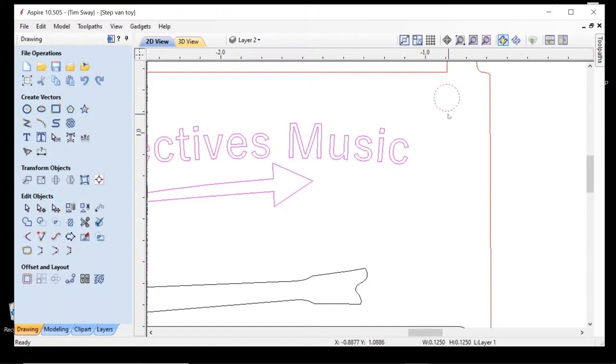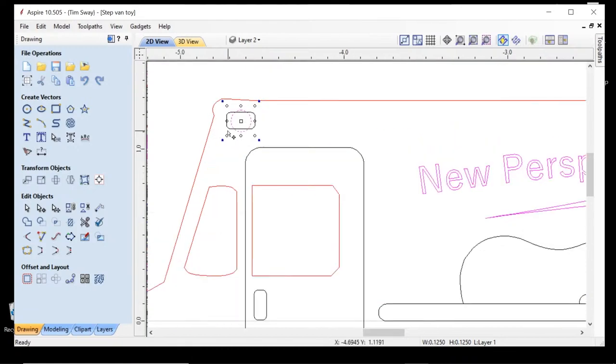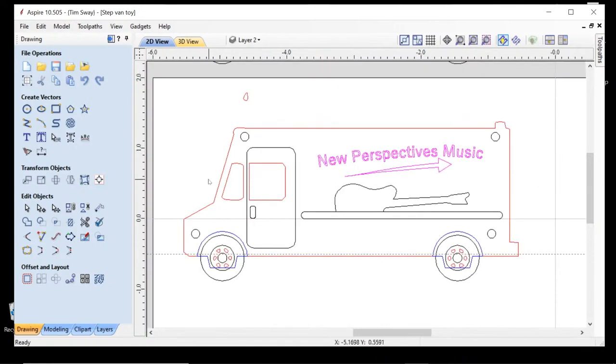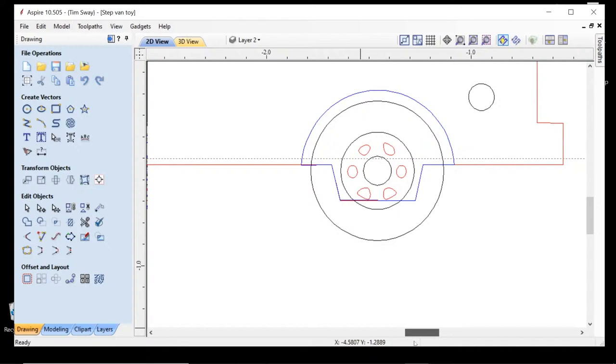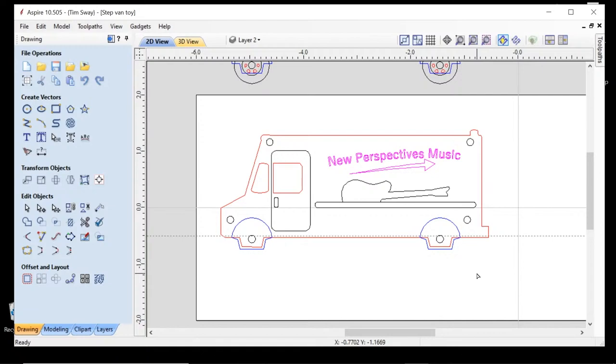The real truck has marking lights in the corners, so I decided to make three-sixteenths inch holes that go all the way through the truck. I want to keep this as a one-sided carve, so I can use three-sixteenths inch dowel to pin the truck together - they'll double as indexing points. That little bit of wood sticking out the end I'll just make red to represent the lights. Later I ended up making the hub a full circle in the toolpath because it's faster for the CNC to run circles instead of those crazy shapes.